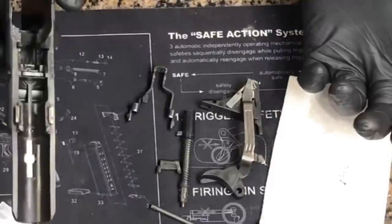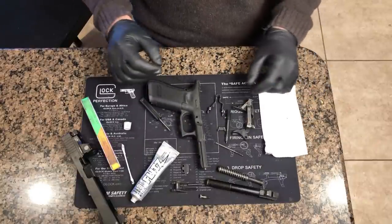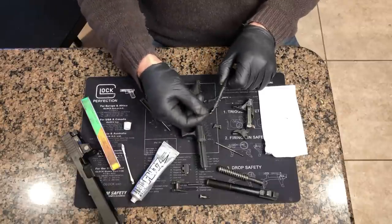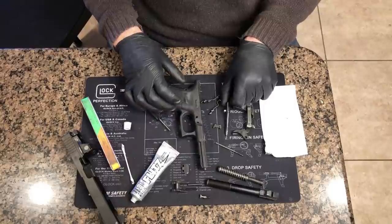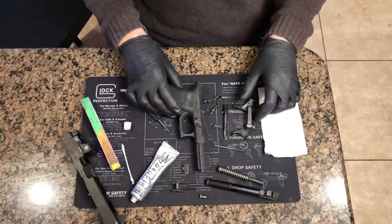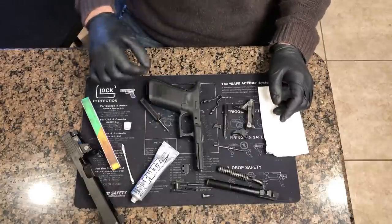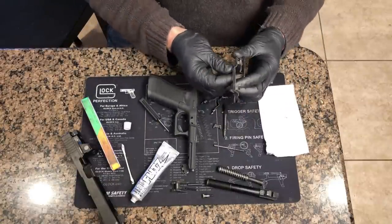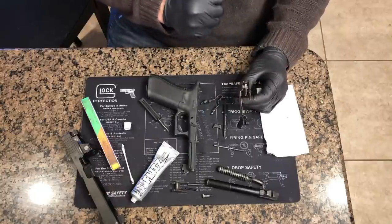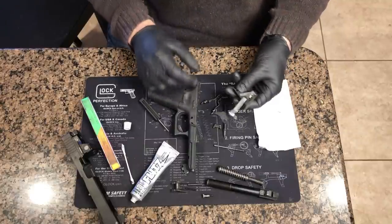And that's going to be basically a Glock trigger job without addressing any of the springs. If you wanted to go crazy, the only other options that you have: you can play with the spring weights on your striker springs. You can change out the striker for longer and lightened strikers. The jury's kind of out on what benefit those necessarily have beyond the longer ones. You can change out the spring associated with the firing pin plunger for a reduced power spring. That's popular. And the other thing you can do is buy a specialty trigger housing that has a set screw that allows you to adjust the over travel once the shot breaks. That would be a full Monty trigger job for a Glock Gen 5.